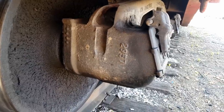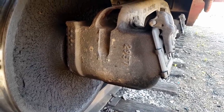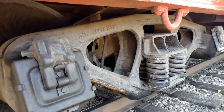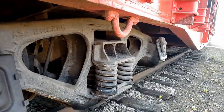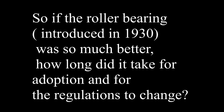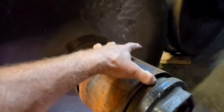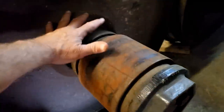This is a good view of a journal box that's in the truck side frame. Interesting — I'm looking at the oil down there; that's where a little bit of oil has come out of the back of that seal. That looks a lot like the journal box we took off the locomotive, except of course it's part of the side frame. There is no equalizer — the side frame is what takes the weight down onto the top of the axle. And here is your AP bearing — three bolts on the end. There's an adapter that fits on top and takes the weight directly down onto the bearing and onto the axle.